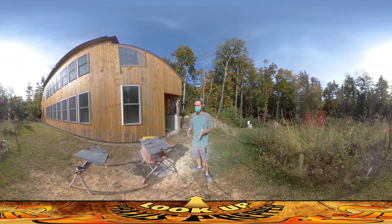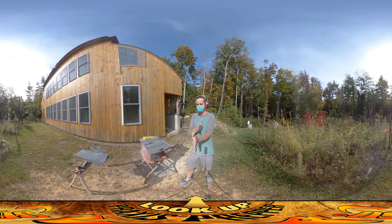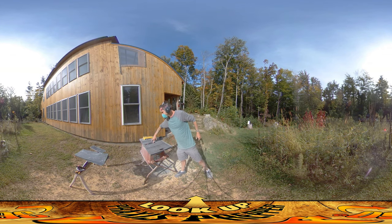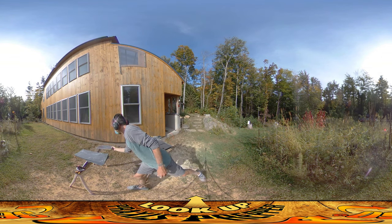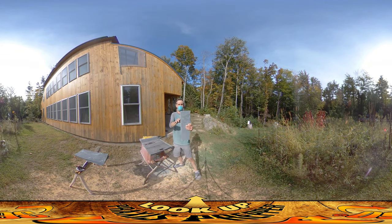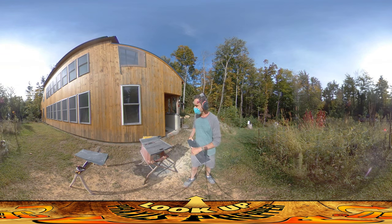They're a foot wide and two feet long, but cutting them in half wouldn't quite work because a foot-wide tile isn't actually a foot wide — they account for like a quarter inch of grout. So these are like 11 and three-quarters inches. Cutting these in half, I wouldn't quite have enough to run it down the center. So what I'm doing is I'm cutting six and a quarter inches off the side, which leaves me a little bit of scrap. Then I'm taking that scrap, which is too narrow for a whole window width, putting it in sideways, and cutting off strips of it.